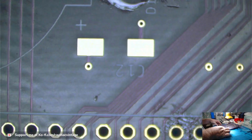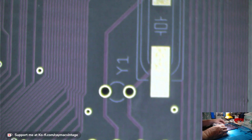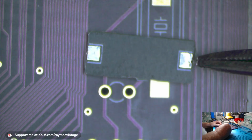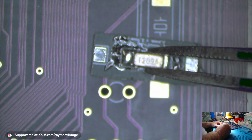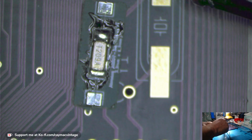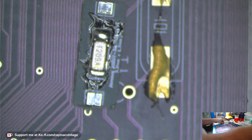And you see, it's the one that goes right here. So we can either use a through hole one right there or a surface mount one, but a surface mount was not available anymore. So what we did was make this little PCB that has the newer size crystal on the top. So then all we do here is put solder pillows on this.